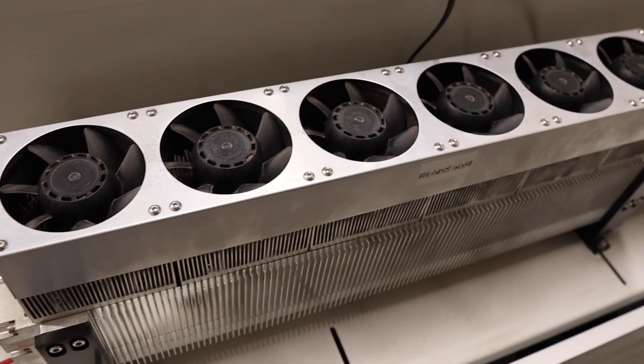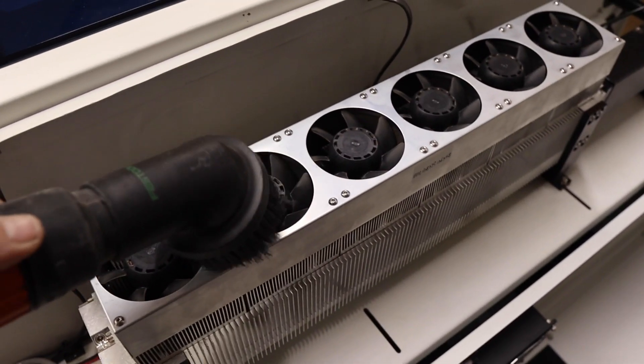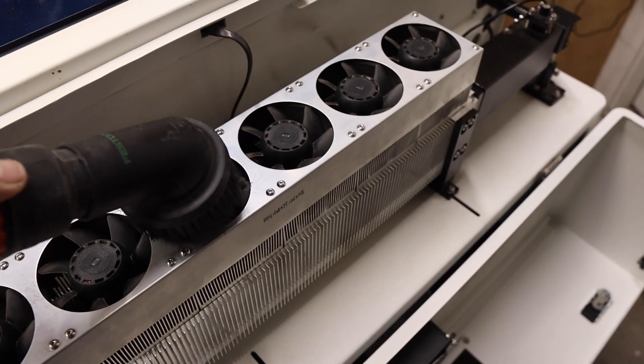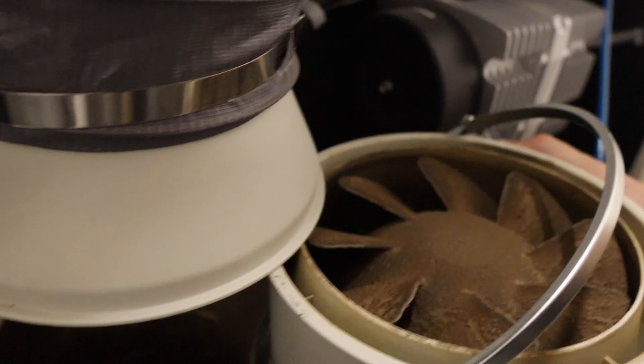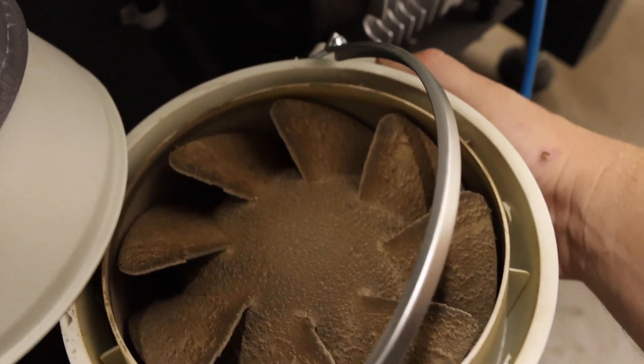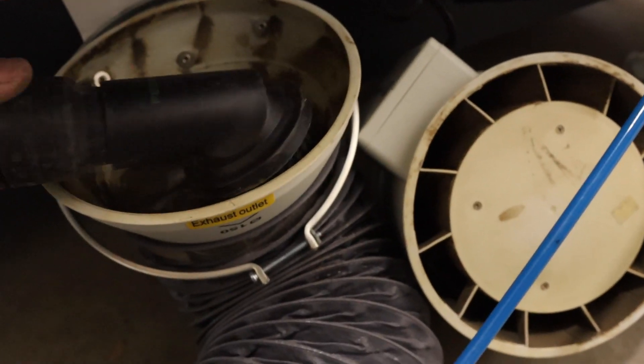The fans on top of the tube keep it cool, and dirty fans can cause overheating. The back of the laser is pretty well sealed off, but dust and debris can still get back there, so it's important to check them and make sure they're clean. To take care of this area, I use a vacuum to clean the intake filters and fan blades. Sometimes I'll also blow a little compressed air on the fans to knock the dust off — but be sure to hold the fan steady so it doesn't spin while you're cleaning it, as this could damage the bearings. Don't forget to take a look at your exhaust fan as well. These can easily get clogged with debris over time, hurting performance. Just take off the center section of the external fan, inspect it, use a vacuum and a scraper to remove all the caked-on debris, then put it back together.